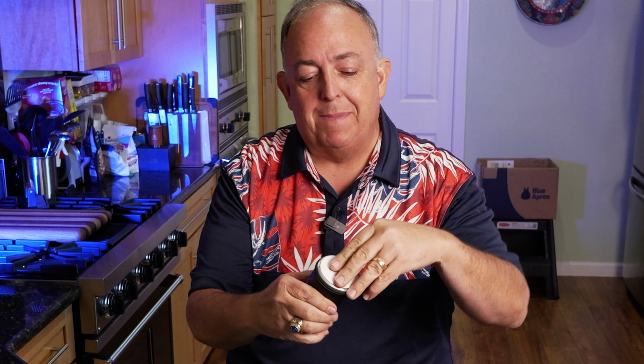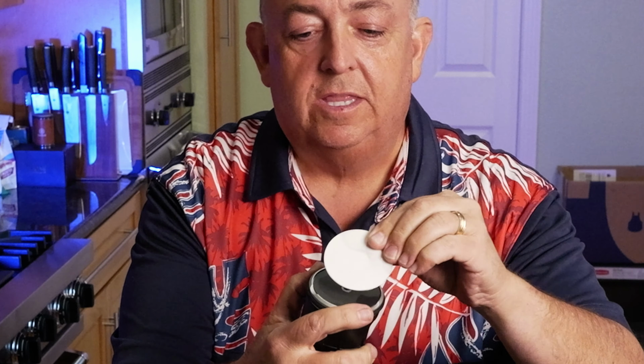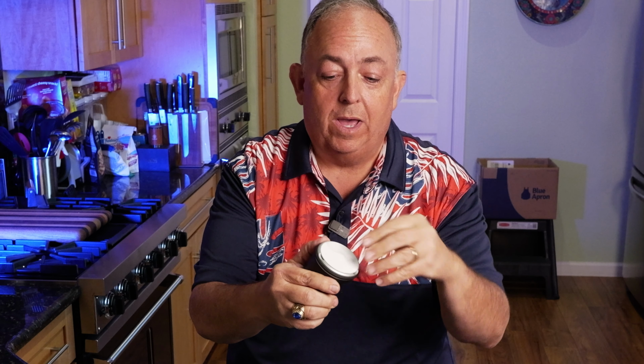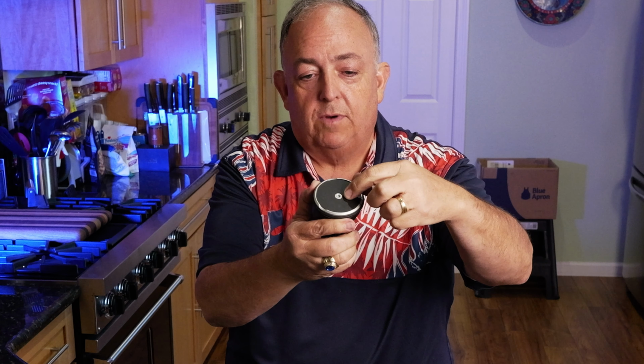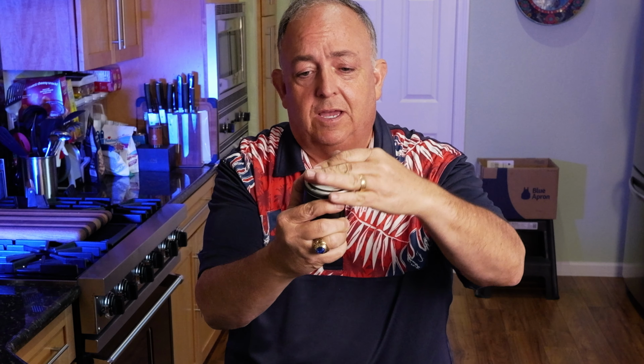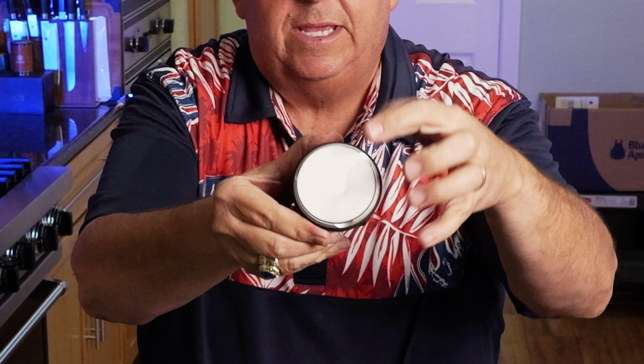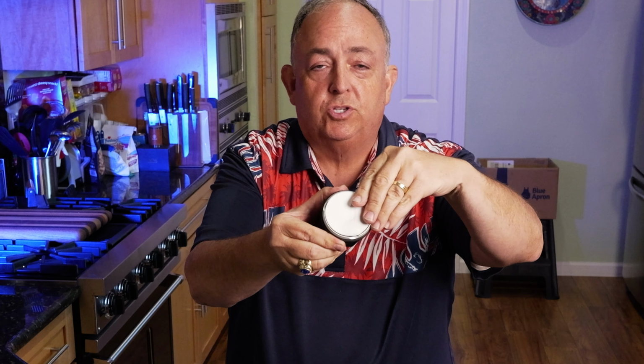And it does come with a magnetic attachment that allows you to attach or change the various grits. This does stay on very well. The attachment area here has a magnetic attachment with a nice soft rubber base, and it has about a 1mm insert where this sticks on and will not go anywhere. Removing it is very easy. They provide 3 convenient cutouts where you can put your fingernail in and lift the disc out very easily.